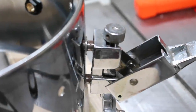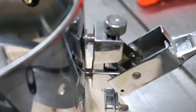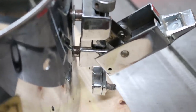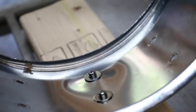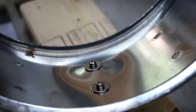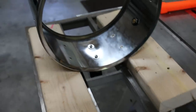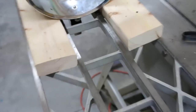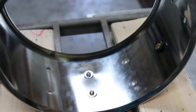It's kind of hard to see on camera, but the bottom mount of the throw-off is bent in. Most likely the previous owner put the drum down on the throw-off and it bent in — you can really see that bulge right there. I have the drum propped up on two 2x4s with the throw-off going in between a hole in the leaf of my table saw, and now I'll take the dead blow hammer and pound it back.